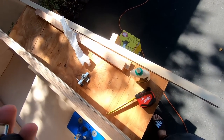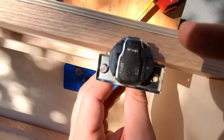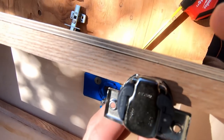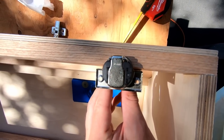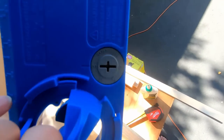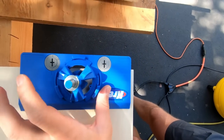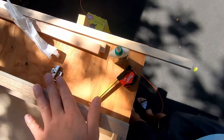I laid the Blum hinge on top of the cabinet where it'll be mounted and measured that the distance between the top of the 35mm socket and where I want the door to sit is roughly a quarter inch. I want to leave only about an eighth of an inch of clearance so the door doesn't scrape the ceiling. I've set my hole depth on the door to three millimeters — so every time I drill a hole it'll be three millimeters from the top for a consistent installation.